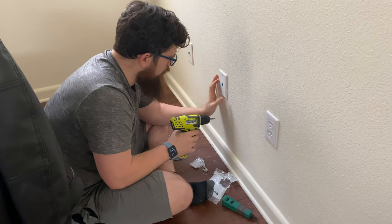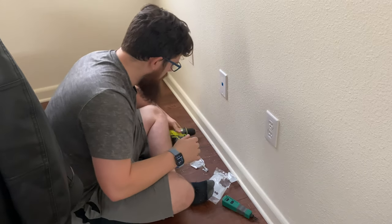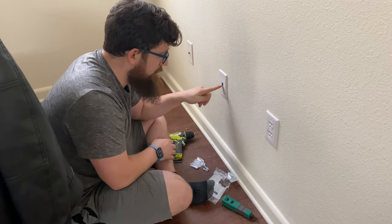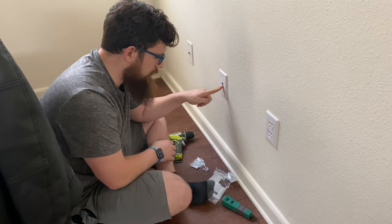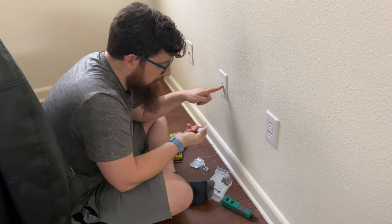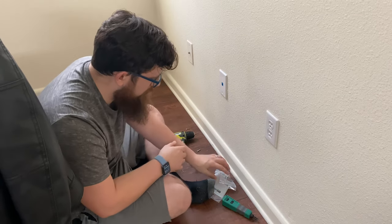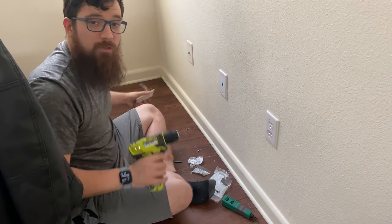And because we don't know, I'll go ahead and seal it up. We don't know for sure. Well, if I'm thinking thoroughly, I'm also trying to do a video at the same time, but we want to make sure that this is cabled correctly. I followed the 568B standard, which is the bottom part of that keystone jack. Geez, I'm having a brain fart. Anyways, let's go upstairs.